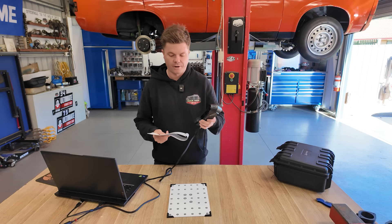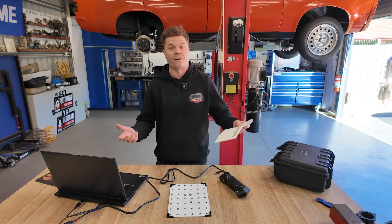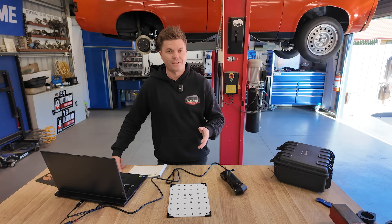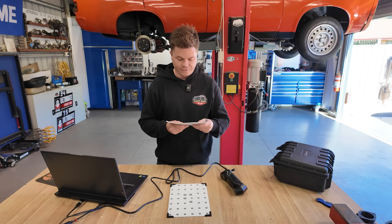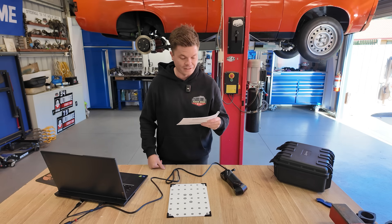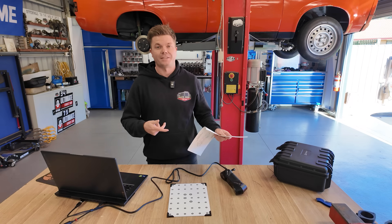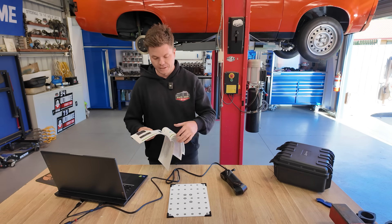The Raptor Pro has three different kinds of scanning modes. First, NIR or infrared scanning, which also does color - so you can scan 3D models that actually have color, like a photo. That's more for model making when you're trying to get an aesthetic look. The other two modes are where this thing really comes into its own: a blue seven parallel line laser mode and a blue 22 crossed laser line mode. In either of those modes it has an accuracy of 0.02 millimeters, and can scan things from 5mm all the way up to 4,000mm. The parallel mode does 420,000 points per second; the cross laser line mode does 660,000 points per second. In layman's terms: it's really accurate, one mode is faster, the other is more detailed.